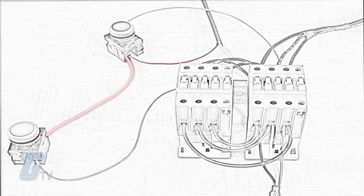As I mentioned earlier, if there are two wires swapped together, then the motor will run in reverse. Now when power is applied to the first contactor from the three-phase coming in, it will be jumped to the second contactor. When the second push button is engaged, the coil actuates and the power will go through the contacts. The power is jumped to the first contactor with two wires swapped and then to the motor.